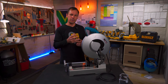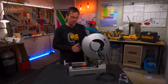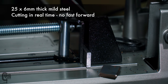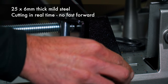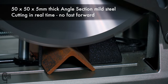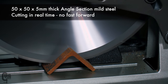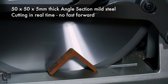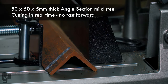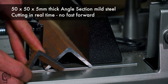With the accuracy, that comes from the type of blade being used, and that leads me on to the cold cutting — that's why they're called cold-cutting saws. Your workpiece, as you cut through it, doesn't actually heat up at all. The heat generated from the cutting is transferred into the chip, which is pulled away from your stock. Compare that to an abrasive saw, where the heat is transferred into the stock you're cutting — so if you're cutting stainless steel, you can actually work-harden it. As for burrs, if you've ever used an abrasive saw, you know it leaves really sharp burrs. These cold-cut saws generally leave no burrs, depending on the blade used and if you're cutting as recommended. Pretty much no burr to talk about.